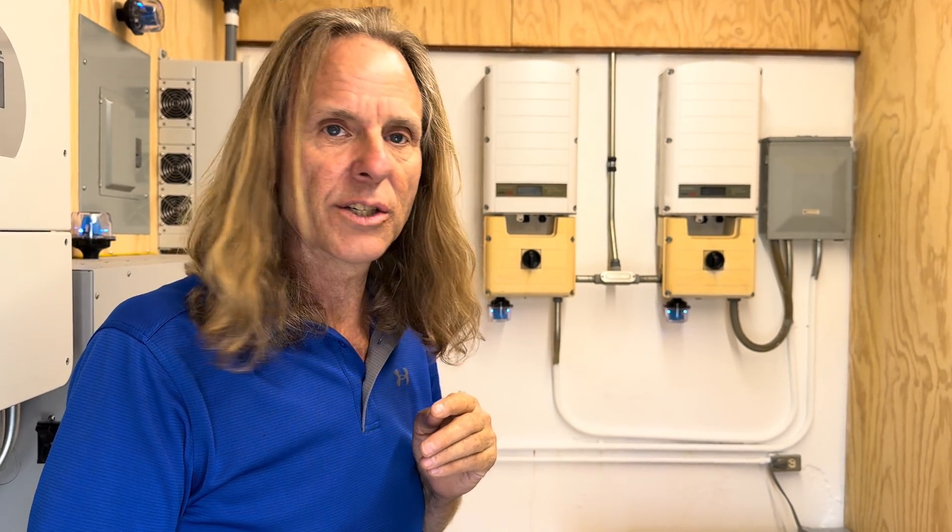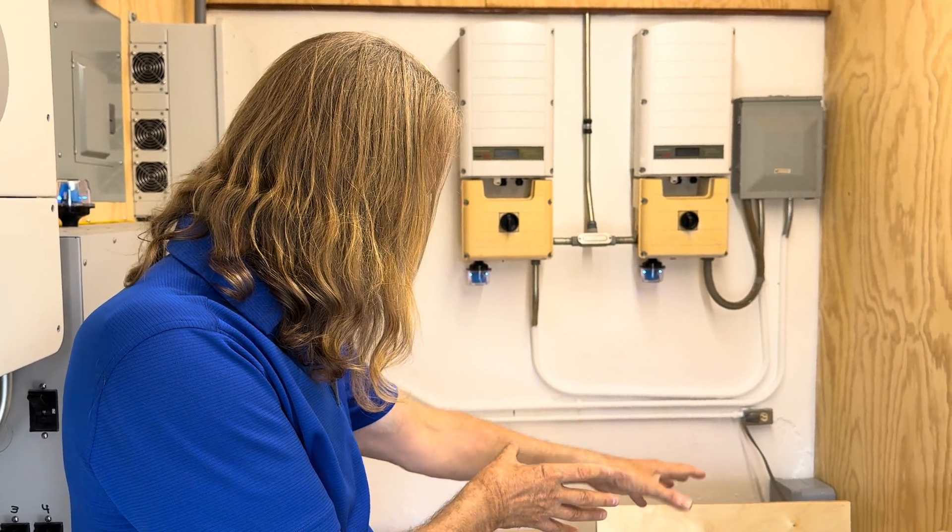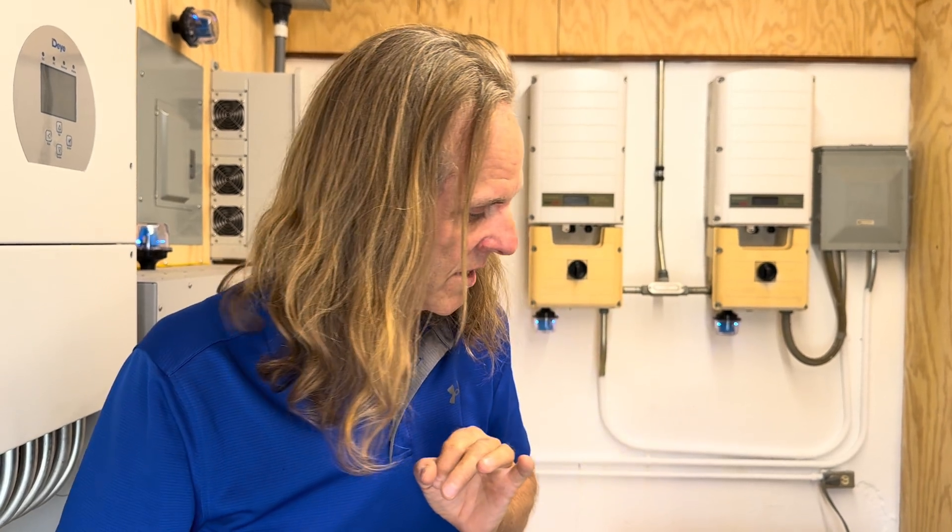You need to get that battery back to top balance. When it's at 100% state of charge, all those voltages need to be the same at 3.65V. You could take the whole battery apart, flip all the cells into parallel, re-top-balance, then reassemble it as a battery. Yes, you can do that — it's time consuming — or I'm going to show you a little trick.